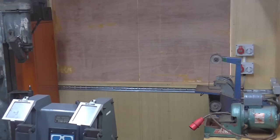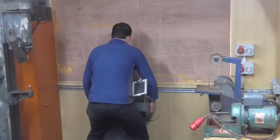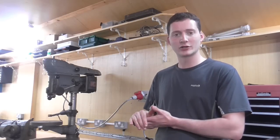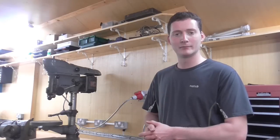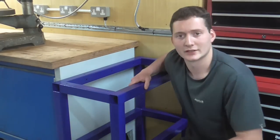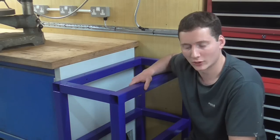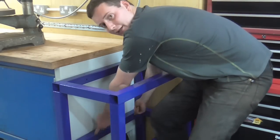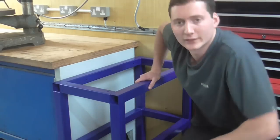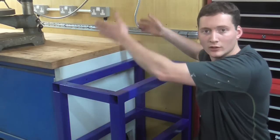Next up some grinding apparatus. Next up I'm going to sort this pillar drill out. The drill is a Kerry Super 8 and it's a bench-mounting machine, but rather than have it take up space on the bench I'm going to mount it on a metal frame — made out of 2x2 inch box section and welded up by a friend of mine called Corin. I'm going to bolt it through so that if it ever tries to fall over it can't. There's going to be a plywood shelf on top and a plywood shelf on the bottom and the pillar drill will sit on top.